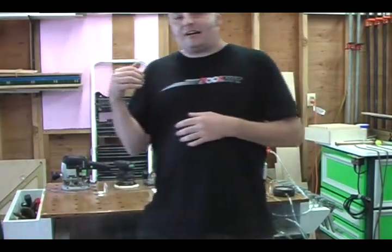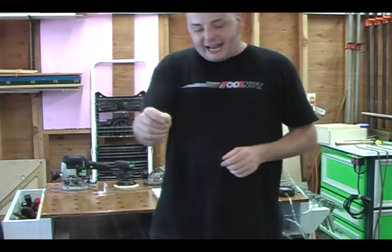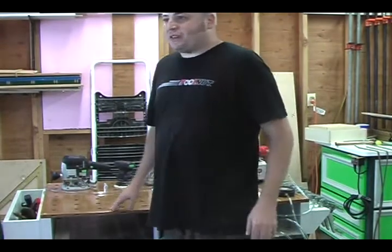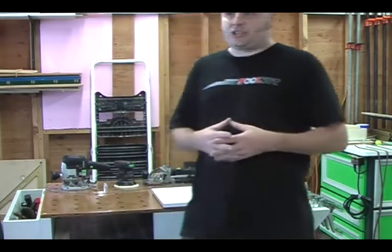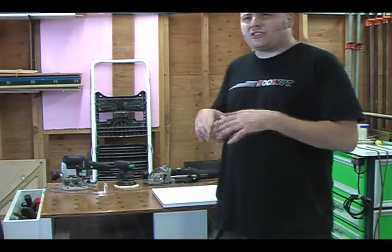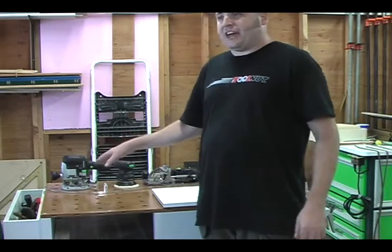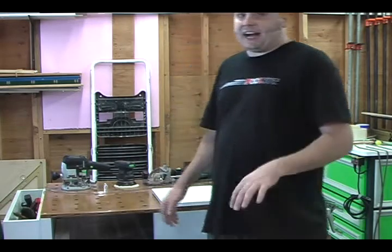But basically, what I did on this model was I bought a very small brush and I bought a 2-inch brush. I took the small brush and I did one coat on the interior of all holes, just one, and then I went back and double coated. Now I used a moisture cured urethane, and I found that that's worked real good, and also the shellac works real well too. Also, what's going to happen is this compresses the stripping so much to the table that it's actually going to bond at some point. So you want this glossed up surface. I actually sanded this down with a 2000 grit after the last coat. So if you feel this, it's super slick and you're not going to have that problem.